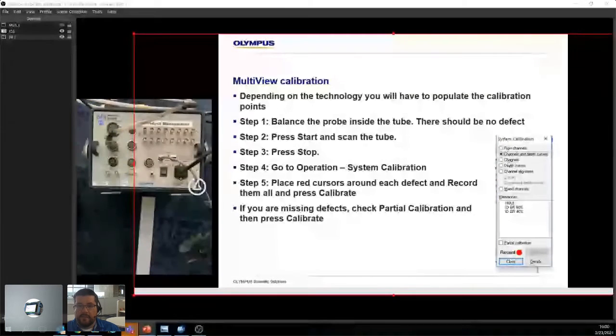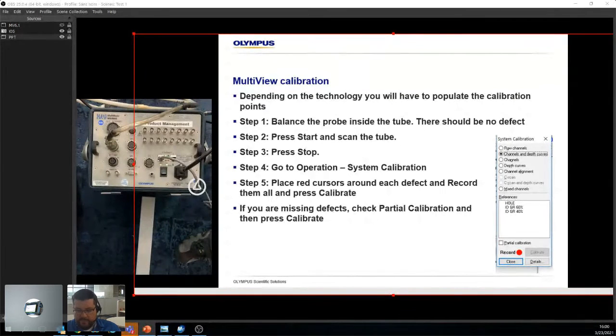What we do with channels in this case is to calibrate a signal. Let's say you have nothing, you're in the middle of nowhere, and you have to inspect the tube. There's a piece of good tubing next to you. I don't recommend this, but what you would need is just a hole. If you can pierce a hole using a drill of a certain size without distorting the metallurgical properties, you can almost calibrate anywhere.